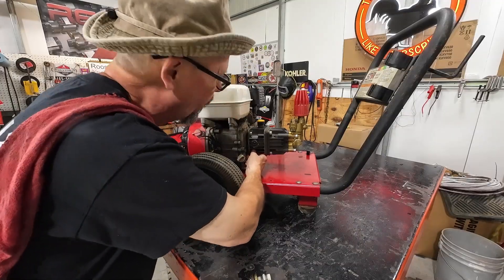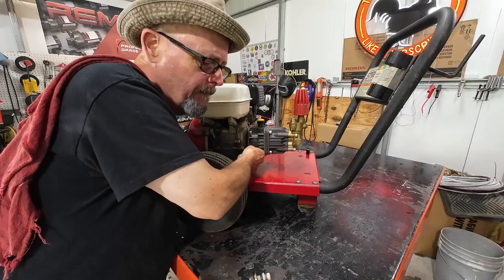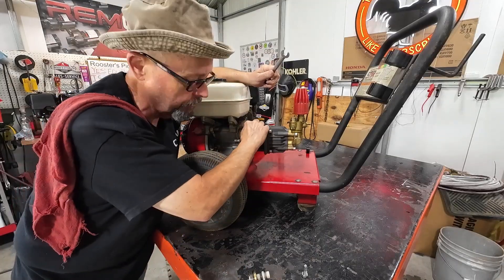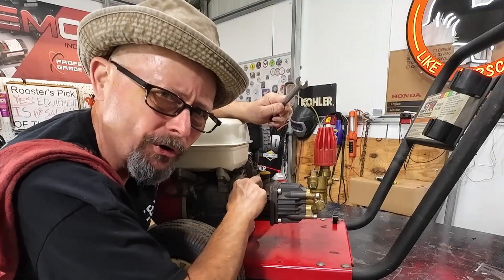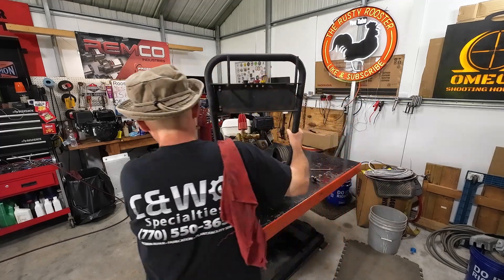Let's think about how that pump operates. A lot of people will bypass pulling this pump because it's a bit of a pain, but it's necessary. The pump's got pistons moving back and forth, riding in a set of seals. The lubrication for that system is water. The coolant for that system — well, it's water too. So if I deprive this pump of both its ability to cool and lubricate the pistons, am I fixing it or tearing it up?